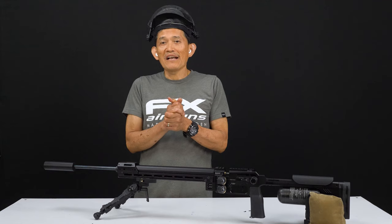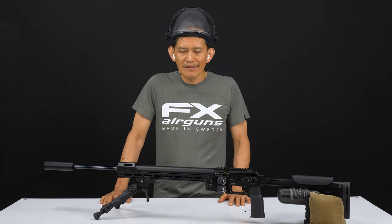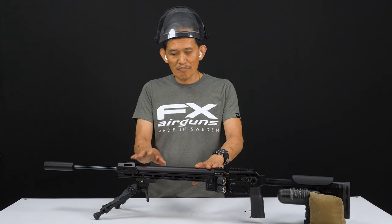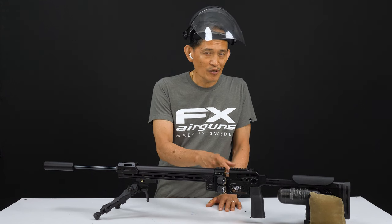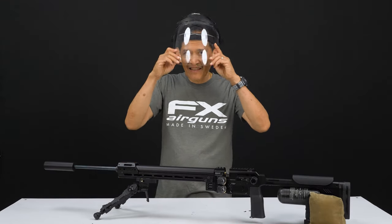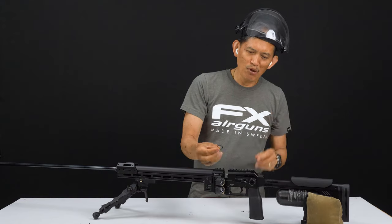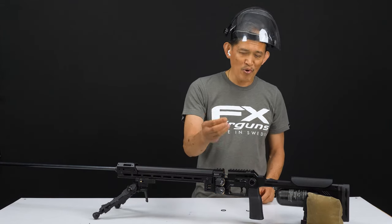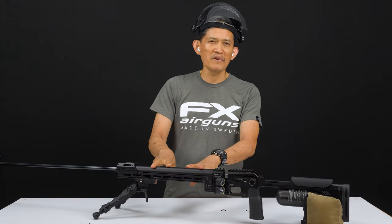Accidents do happen and sometimes you forget to bleed out the plenum before removing the barrel. I got this gun down to 100 bars, maybe you got 150 or above PSI in your plenum. And if you had a larger caliber, it would be more dramatic blowout. So that was a .22 caliber — I'm going to demonstrate pulling out the barrel while it's still pressurized. Make sure your ear protection and eye glasses are on. What happens is you blow out the O-ring that seals the front of the barrel, the O-ring that seals the inner barrel, and your breech O-ring is going to blow out. That's dramatic.